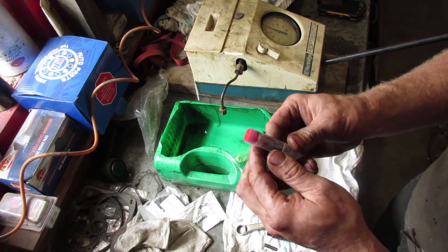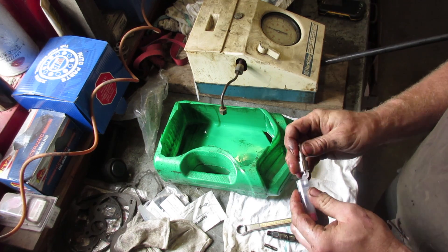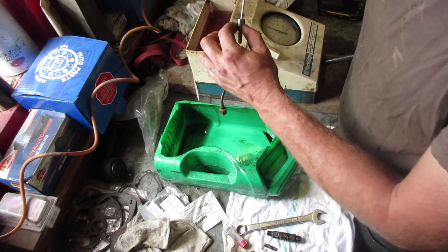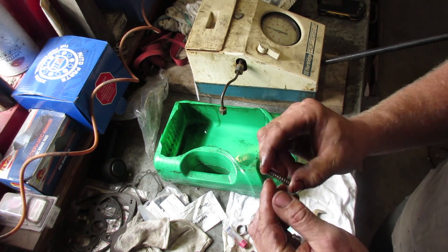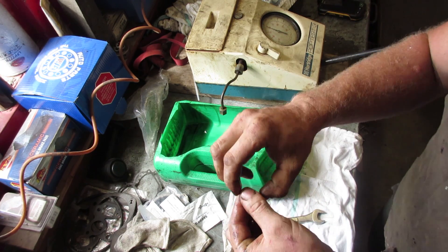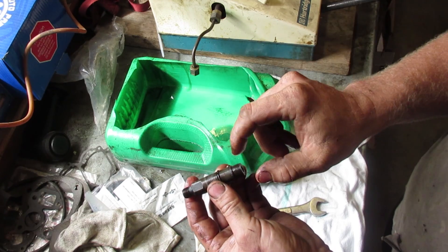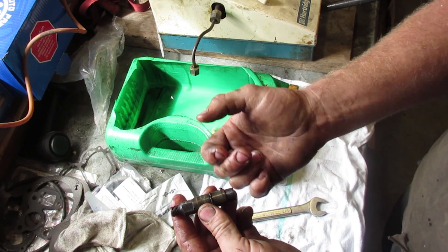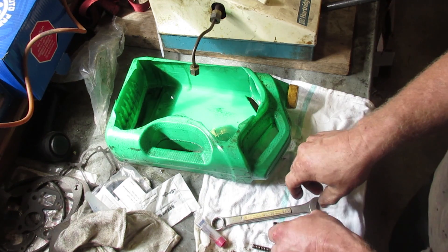This one is no good, so we've ordered a new one from Bosch, going original equipment. Look at that, all shiny and new. I'm just going to lube that up. Now, to increase or decrease pressure on this type of injector — to make it pop at a higher psi — you have to add shims to the back of this. The Perkins injectors would have an actual adjustment on it; you can just tighten it. It's another cap, and you can tighten that to actually increase the pressure on it.